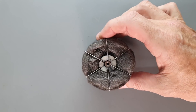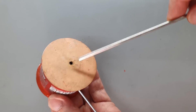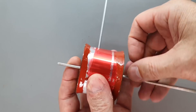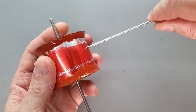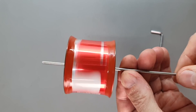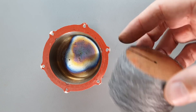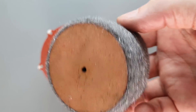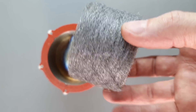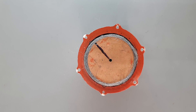I thought I would pay homage to the aluminum can gods, so I made a new displacer out of a piece of a Coke can and some very thin printed circuit board material. This was a total fail — the circuit board material burned, releasing horrible toxic fumes, and totally gunked up the inside of the engine. I realized I got super lucky with my first design attempt. The displacer regenerator is actually a really tricky part of the whole engine, and there's lots more fiddling to be done.